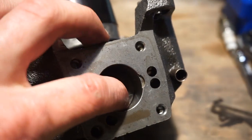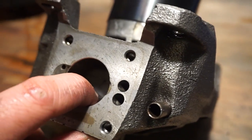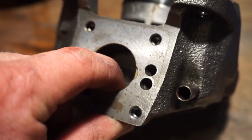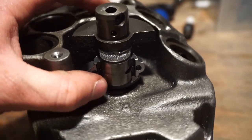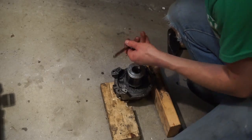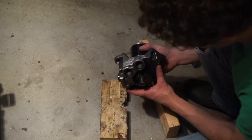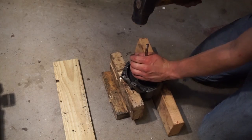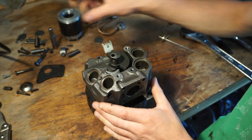It's going to be really hard to drill with the piston in there. I could do it, but the problem is I won't be able to deburr it easily and the piston is going to get all galled up. So I really need to take the piston out. The only way to do that is to take the crank out, and to get the crank out it looks like it's pressed onto the armature. I'm going to take a steel rod and pound it out. And there we go — I've removed the armature, so now we can take the engine apart the rest of the way.